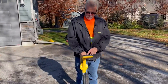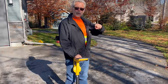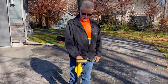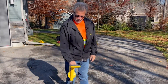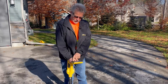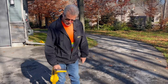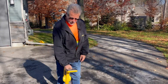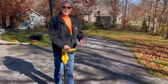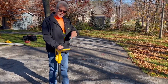In fact, I go off scale. I'll turn my gain down a little bit and start to do my comparison. I've made signal in one location but I'm picking it up in two locations — this happens routinely. Now I'm going to try and decide which of these two lines is the target and which one's going to get the red paint. If I move my receiver back and forth, I've got lots of signal. The peak and null tells me it's right here — my peak tells me I've got my foot on it. I'll put it down on the ground: it says three foot seven inches deep. I'll raise it about a foot up and now it says four foot seven. This is a pretty good signal, but I'm still concerned. Let's go back and compare this field to that field.